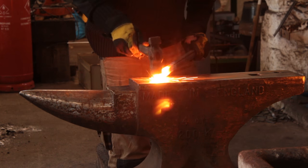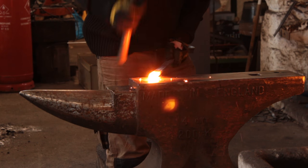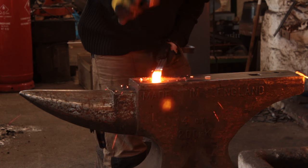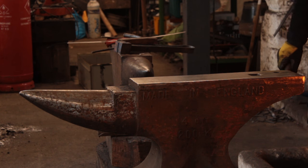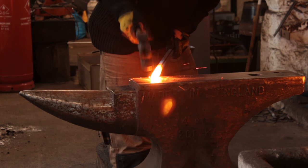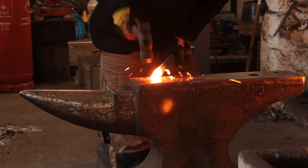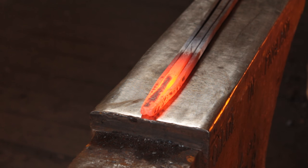You could tack weld them with an arc welder or a MIG welder, or wire them together — I'm just holding these freehand. I do it often enough that it works for me. Again, one heat to tack, one heat to weld. I'm not really going to bother blending in these welds at the moment because there are external components which will be forge welded to this part in the next video. Here is the part with all four pieces forge welded together.